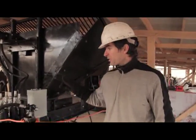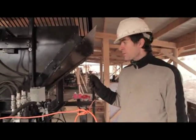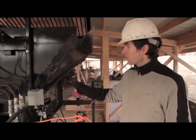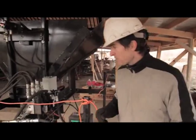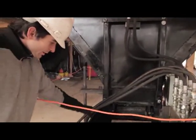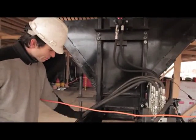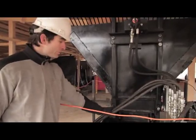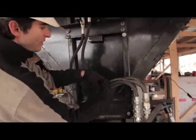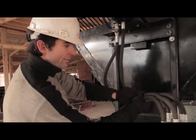A big point about hoses: you'll see a bunch of hoses all over the place, but in real operation, upon pressure being sent through a hose, the hose will flex like a muscle and jerk. If left loose, these will over time rub against each other and against the frame. You have to bind them tightly and tie them up — they can't rub like this, as a few hundred bricks will readily abrade the rubber, the metal braid will show through, and you'll end up with a broken hose. Have some kind of a tubing or tie system, with the hoses firmly tied together so that even if they move and jerk, they're not sliding past each other and wearing out.